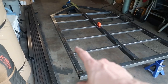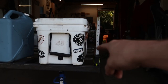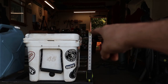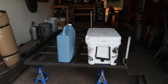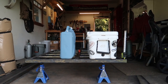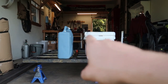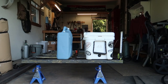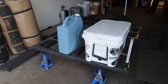I'm going to start by measuring to figure out how tall I want the walls. That's 16 inches from the base of the trailer up to the top of the rail — 16 inches looks good. That's with a cooler and also a jug for comparison, and I feel like that's a good height for an average load for a trailer like this. It'll also allow a strap to be run through the top handles of jugs to help secure them in the trailer.